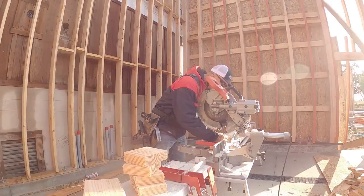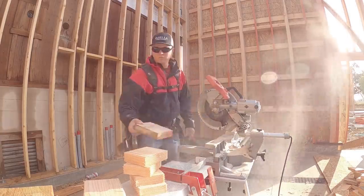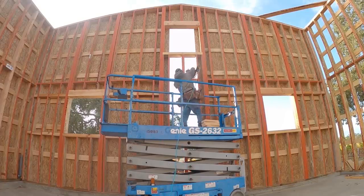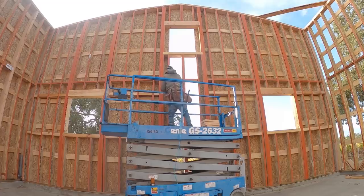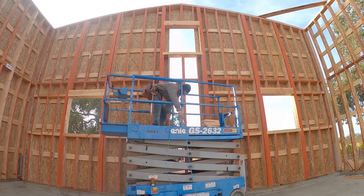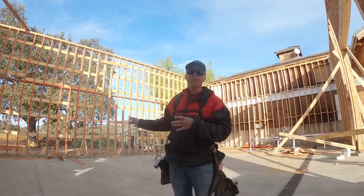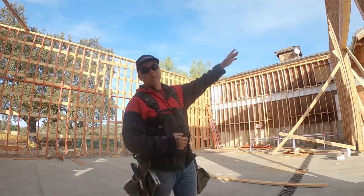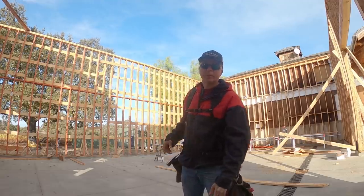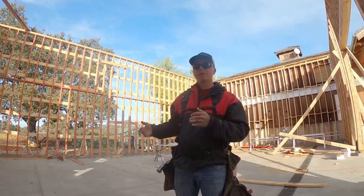It's beginning to look a lot like Christmas. So now, aside from shear panel on this back wall, this unit's just about wrapped up. What we're going to do now is take down these A-frame braces, but before we do that, we're going to throw up our braces that are going to line these walls. We'll have one brace going from the top of this wall down to the door opening, and another going from the top of that post down to the bottom. That's going to lock us in on both sides and keep us laser straight so when we put trusses on, we don't run into any variance.